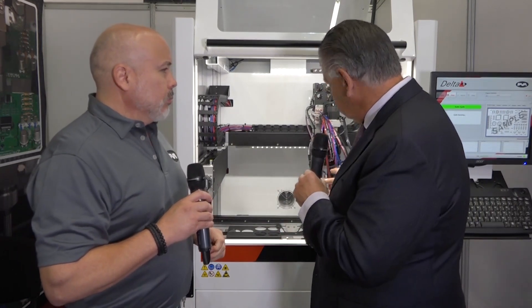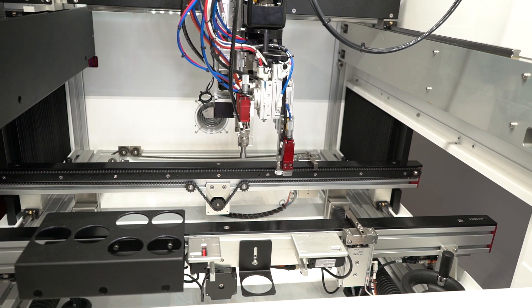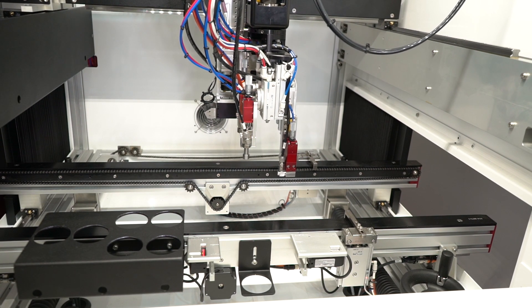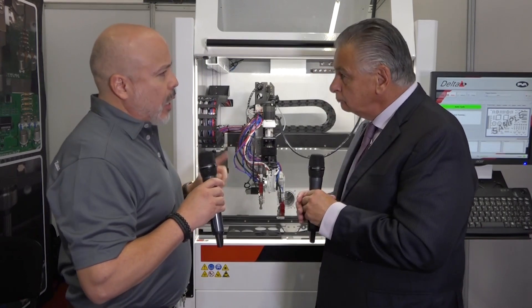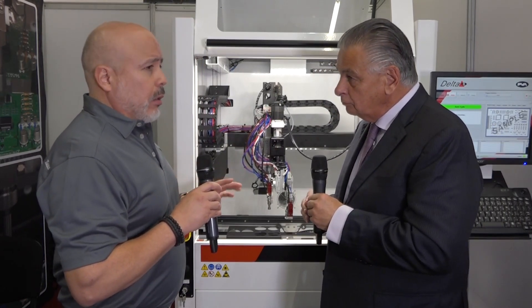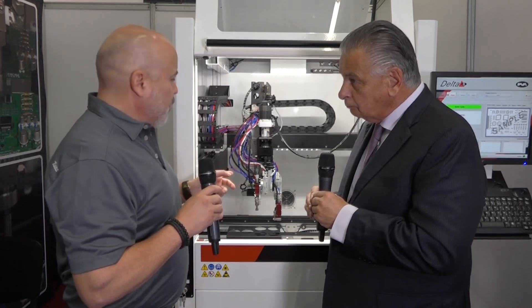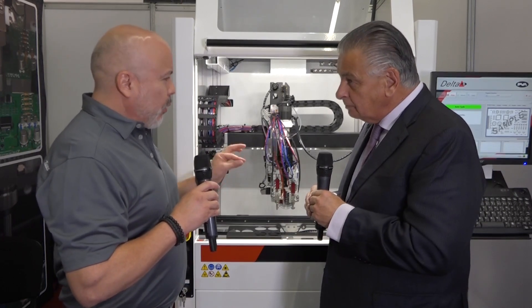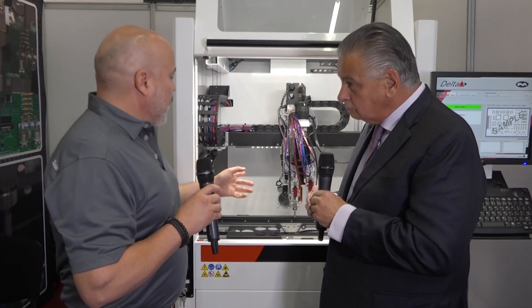This is one of the standard machines behind us, which has three valves attached. The head configuration aims to have non-atomized and atomized valves for different viscosities of conformal coating materials. Low viscosity works better with a non-atomized valve. We also have a jetting valve for very critical, very small spaces with very repeatable dispensing, and the UF ultra-fine spray valve that gives very good edge definition. This is the best head configuration for conformal coatings.